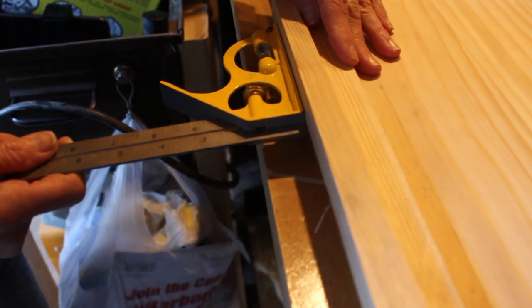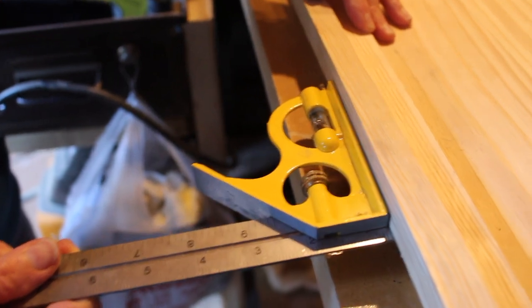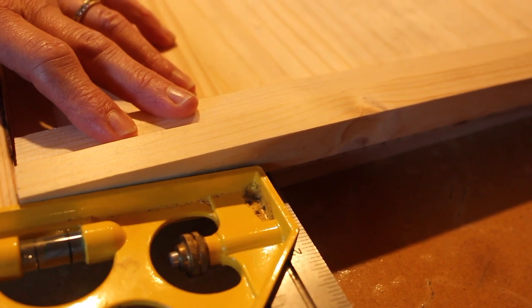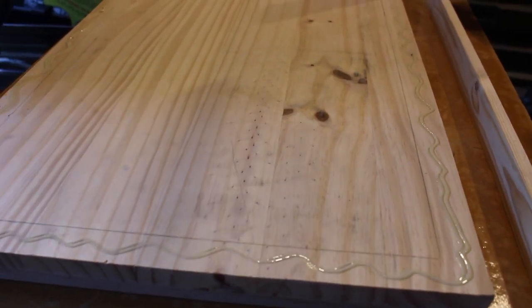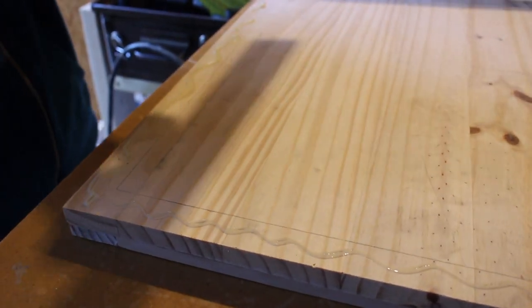We're ensuring our reveal around the frame is half an inch, to give the impression of a frame. We're using a mechanic's square to do that. All you have to do is keep one face flush with your edge, push until you're touching the ruler's edge, and then you know you're exactly half an inch. We've made marked lines and are now placing the faux frame on those lines, attaching it with brad nails.